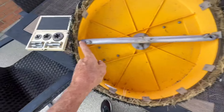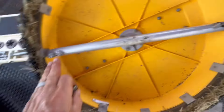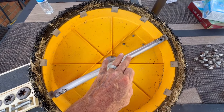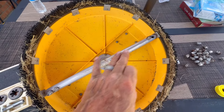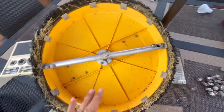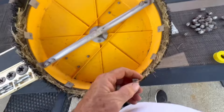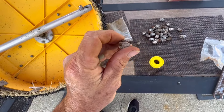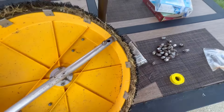So what I'm going to do is put a 2503 here and a 2503 here — these are 25025s on the inside. I'll be using this a lot with the 10 GPM machine so that will help. I'll order a set of 25025s — it's probably due regardless. Off camera I'll put these in, and of course I have Teflon tape. We're going to see if this works.